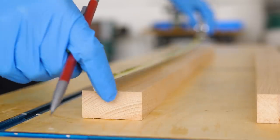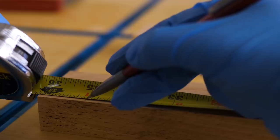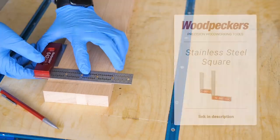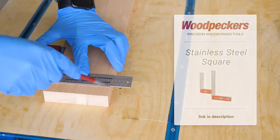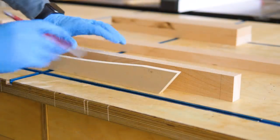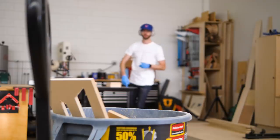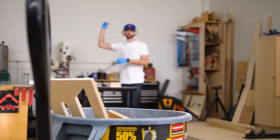The next morning I grabbed my blanks and began refining them, starting with the stretcher pieces. Back when I had ripped these, I had made them their finished widths, so next I had to mark out what their finished length should be. After that was done, I could grab my template and trace out the curved detail shape they would have along their top edge.